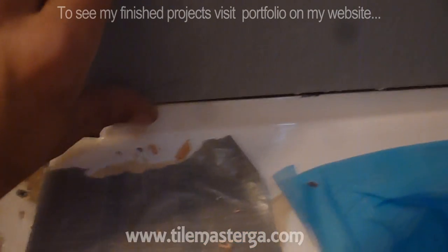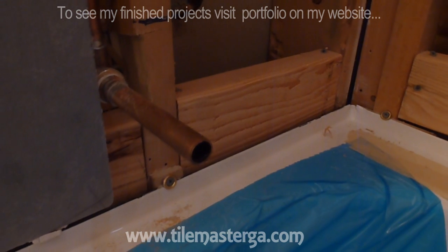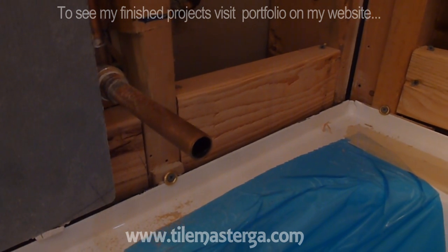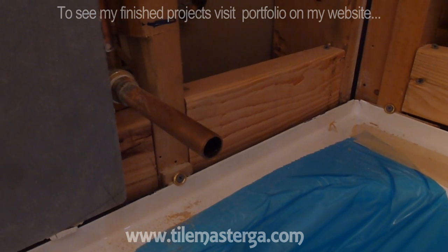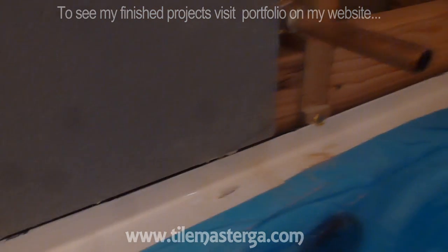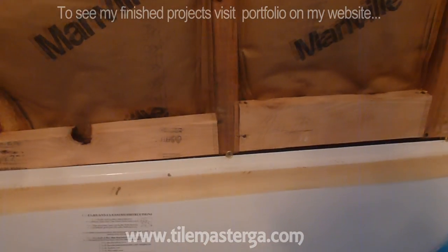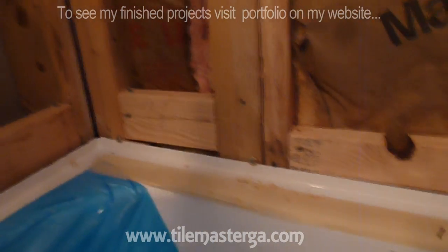So the goal is to adjust the tub or shim the walls to the point where the board, when installed, sits farther than the lip and the edge of the tub. So we have the tub nicely going against the studs on the back wall. The opening was slightly bigger than 5 feet side to side. So what I did when installing the tub, I centered it between the spacing, and I left some gap, but not as big, so when the board is installed, it will actually pass the level of the lip, the edge of the lip.